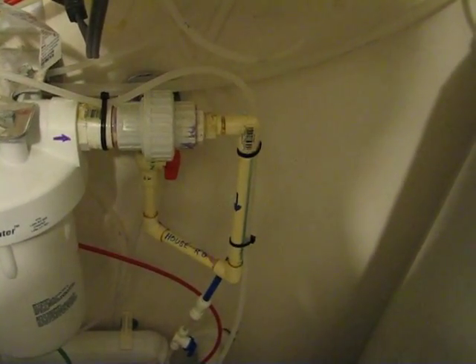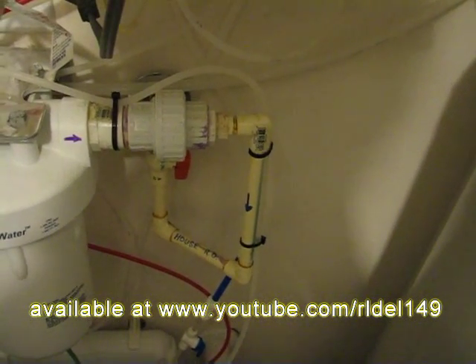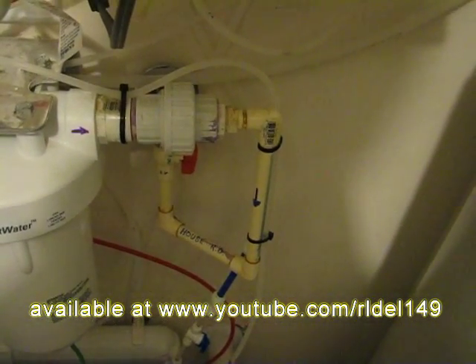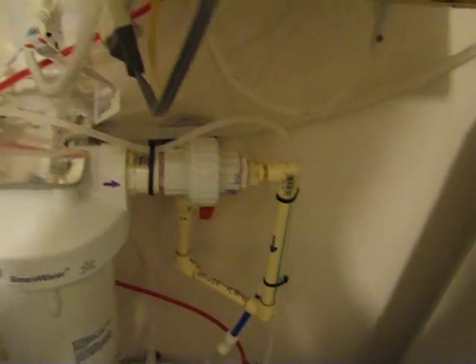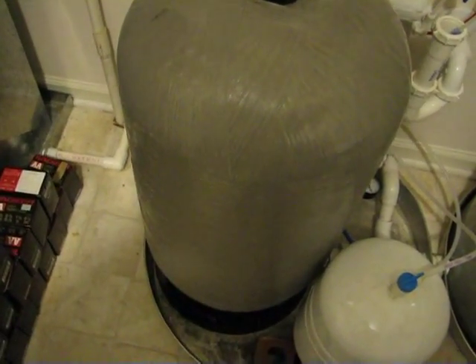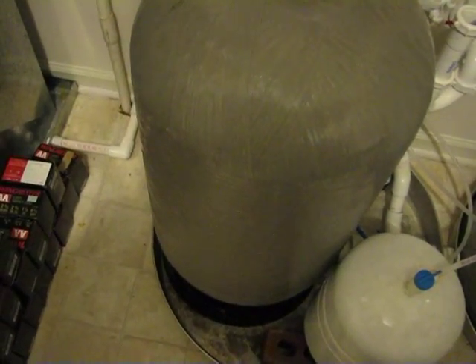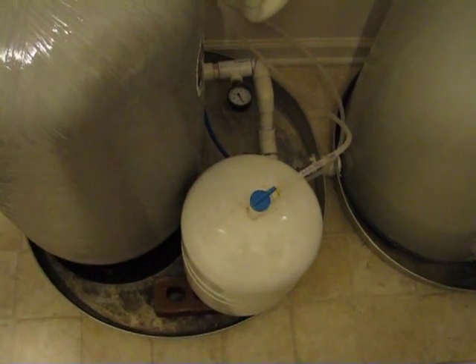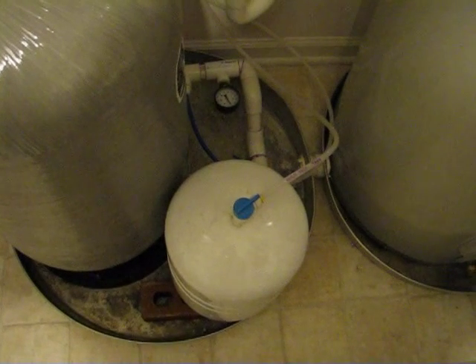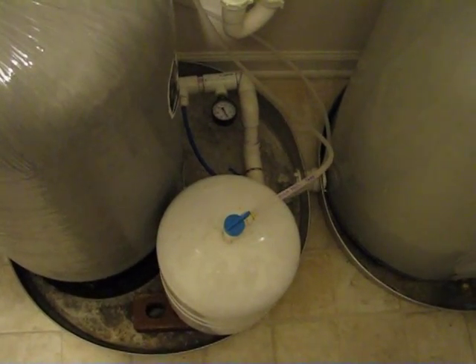The bacteria won't hurt me or my family, but they will corrode my pipes. So using non-corrosive plastic helps. In the case of reverse osmosis, we've taken all the minerals out and the water can be highly aggressive — another reason to use all plastic parts. Coming out of the system, we come down to the tank, which is much larger than a standard drinking water system. There is also a small tank about the size you'd find for an under-the-sink system, used in conjunction with a small high-pressure pump to create the high pressure zone.